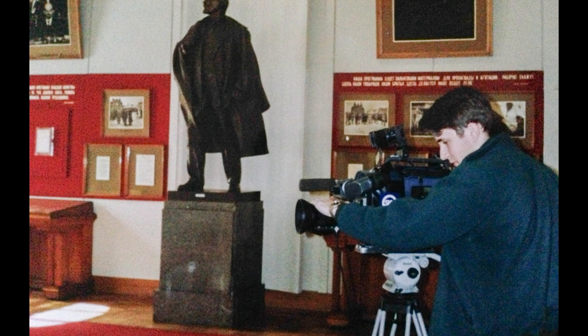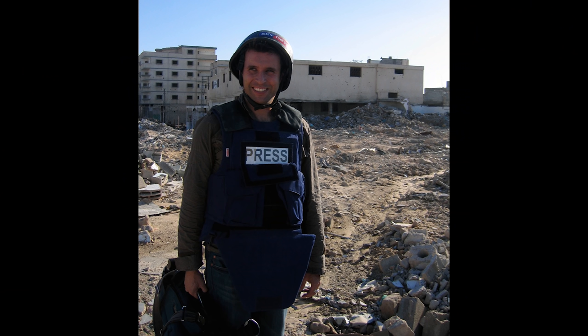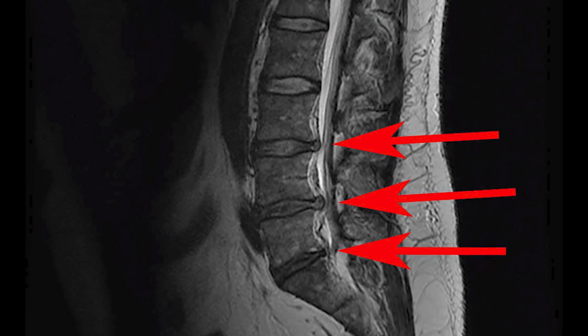I just missed out on them when I started working for Sky News back in 1989. And the first professional video camera that I used there was this Betacam SP BVP50 front with the BVV5 back. A truly heavy beast, and is the reason why my back is the mess that it is. It used 3 CCD solid state sensors for the red, green and blue. Their size, the same as this tube camera, 2/3-inch.